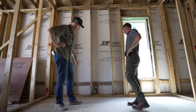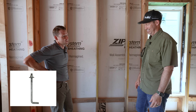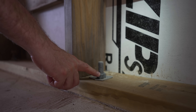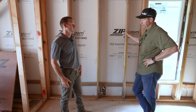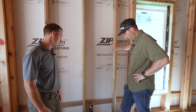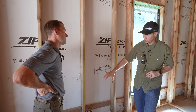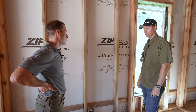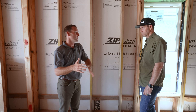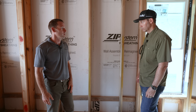Speaking of shear, I'm seeing some hardware that I don't always see. What is your anchor bolt pattern? It looks like you've got a bunch of anchor bolts on this house. We put anchor bolts every two feet — there's basically a 5/8 inch, 10 inch long anchor bolt. So these are cast-in-place J bolts? Yes, every two feet throughout the home. Code is four feet; we did every two feet. Was it hard to know your stud layout knowing you've got 24 inch on center advanced framing but also 24 inch on center J bolts? We've done it a few times now and there's never really been a conflict. There are a couple throughout the house, mostly at doors where you have a bunch of studs together, but for the most part it fell out pretty well.